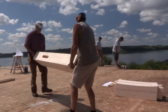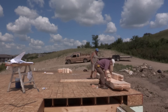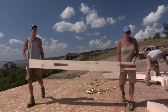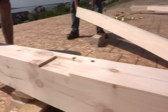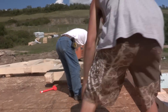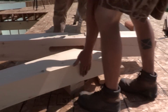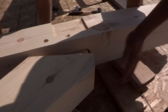Individual timbers are usually light enough to be hand carried to where they need to be. You're now ready to start building your timber frame. When constructing the frame bends, timbers need to be elevated off the floor to accommodate strapping and eventual lifting by crane. Make sure you have some blocking pieces pre-cut and ready to help elevate the wood high enough for crane access. Our frames are pre-built in our shop and are tested for fit, but you'll need some tools to finesse the joinery into place.